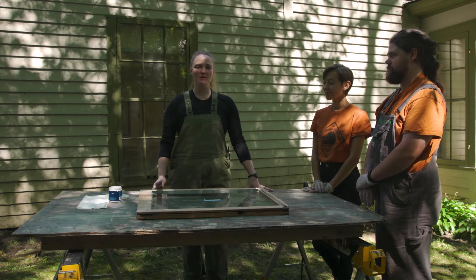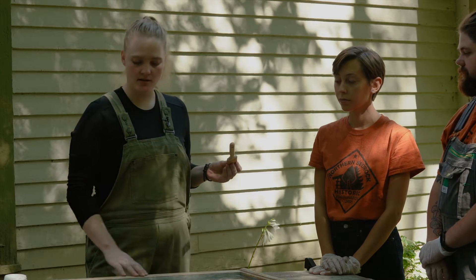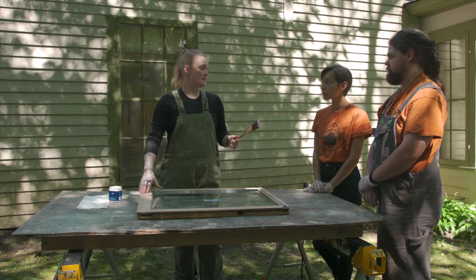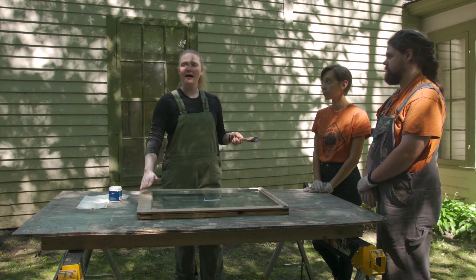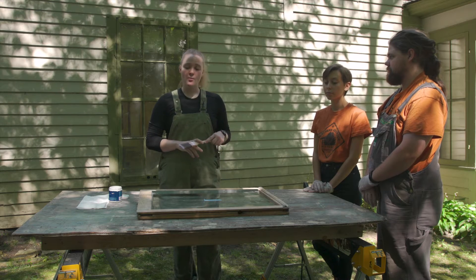Hello, welcome back. I'm Laura, and in this video we are going to go over how to paint your sash. Prior to glazing this window, we did sand the face of it and the parts we were going to add paint to. The other thing we did yesterday was add water repellent preservative, which is just one extra layer of defense for your wood. However, it needs about 24 hours to dry before you put your primer and top coats on.